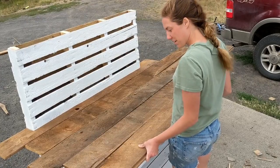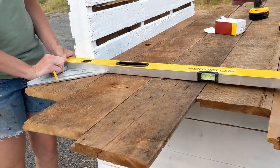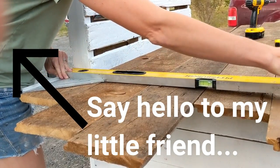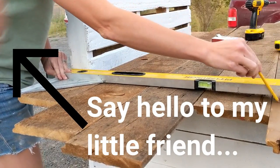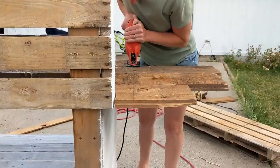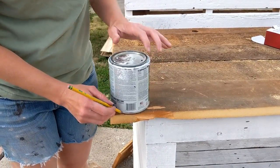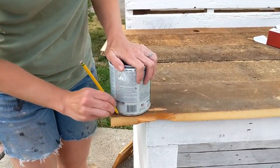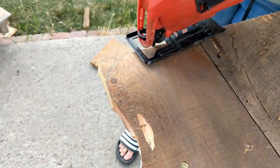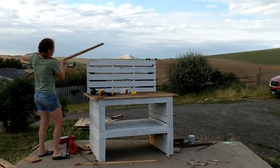Not all of my pieces worked. So once you get all your pieces on the top, I just went ahead and screwed mine down into my side pieces from the top. Then I just trimmed them down to where I'd have about a 2 inch overhang and cut that out — I always like to cut my pieces out all together so it makes a nice smooth edge. I wanted to get a little bit fancy here, so I did some rounded corners using a good old paint can. And once you get your edge all cut out, go ahead and just give it a quick sand just to smooth out any splintering and make it look a little nicer.